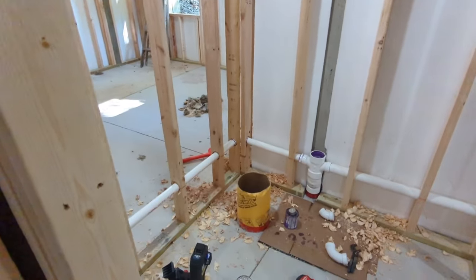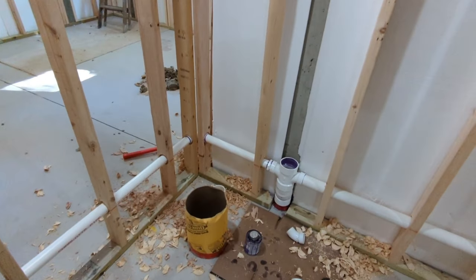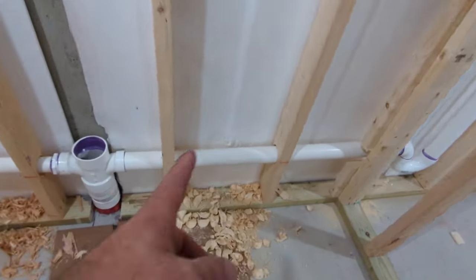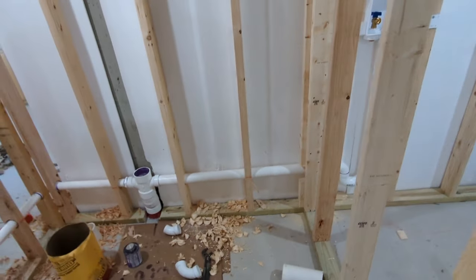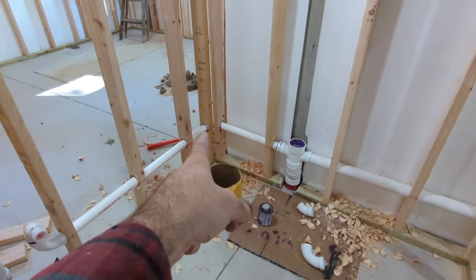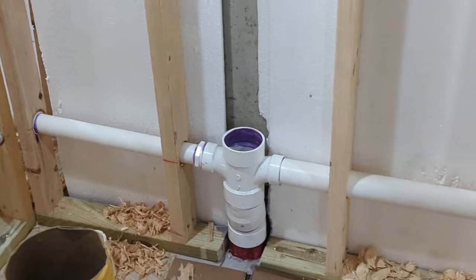I just drill the 2 9/16 hole for everything. You can run a 2-inch or 1.5 inches through it. You have more flexibility on the angle within it, because obviously the 1.5 inches has more room around it inside the hole. 2 inches just sort of barely clears it. And the hub end of a 2-inch fitting doesn't quite, I mean, you might be able to jam it. But anyway, the hub end of 1.5 inches obviously will fit right within the hole, which is a benefit.